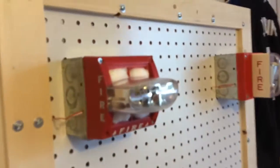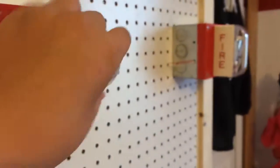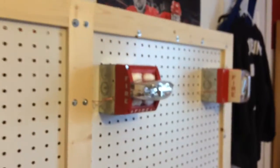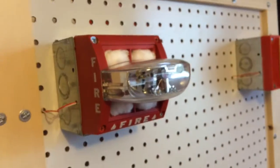It has a giant chunky ADA strobe — it's a really awkward strobe. It's 75 candela and this thing is set on 800 hertz, and the panel is coded to Code 3. I want to change that right now.